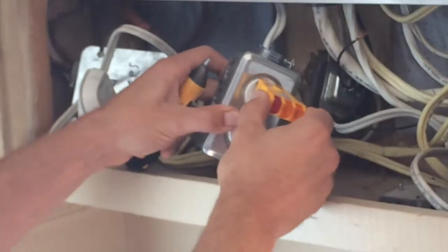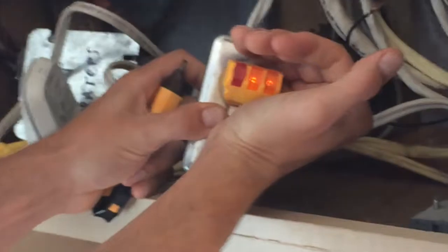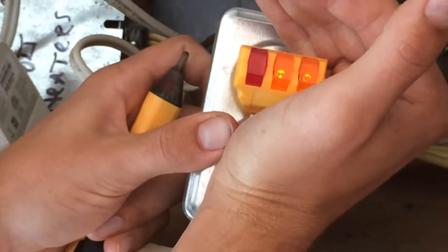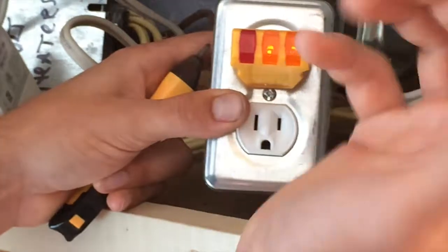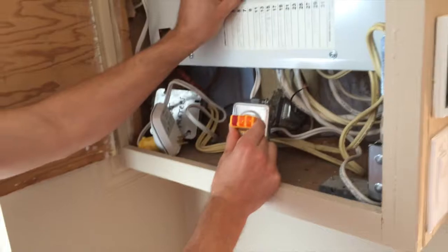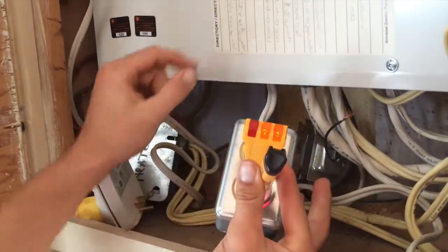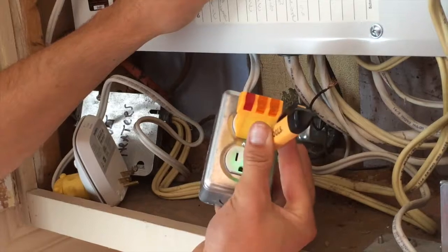We plug this in as well. You might not be able to see it, but it's lit up. That means this circuit is okay — it's grounded and everything is good. It doesn't show you the voltage, but it shows you if it's live or not. You can then go to the panel and have someone shut off the circuit. Essentially this is how it would look — there you go, it's off. The same thing works with your plug-in tester. It's off — a really good indicator.